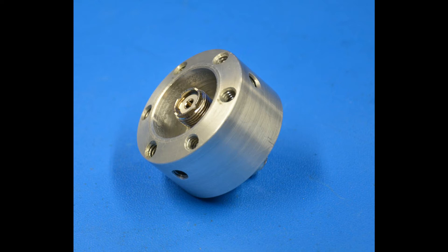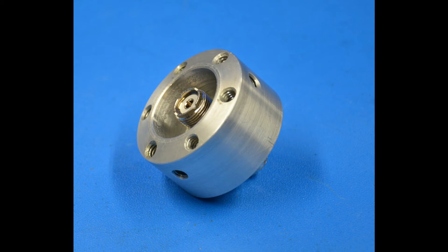I tried as many as 10 elements and it didn't seem to change the SWR on the antenna — six ended up being a good number and worked out well. Here's an example of the aluminum element threaded with the stainless steel locking washer. These elements simply hand-twist into the hub and fit in there pretty snugly. If you're going to use this in a permanent installation, you'd of course torque those quarter-20 seven-sixteenths nuts down permanently.